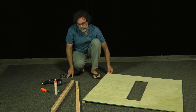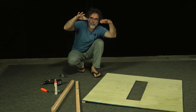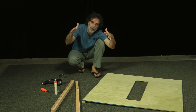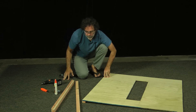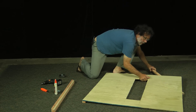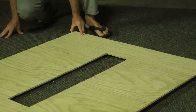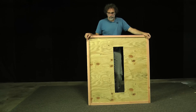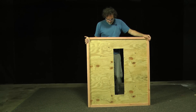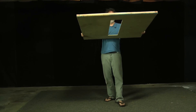You don't have to put the strips on if you use a thicker piece of plywood. But if you set this roof on top of your shadow box, after about a month or a few weeks it starts to sag — that's why I put the reinforcement on. Go ahead and put your wood all around before you screw it in, just to hold it up. The roof is finished — I've just screwed these strips onto the sides with some wood glue, and now this will sit up on top like so.